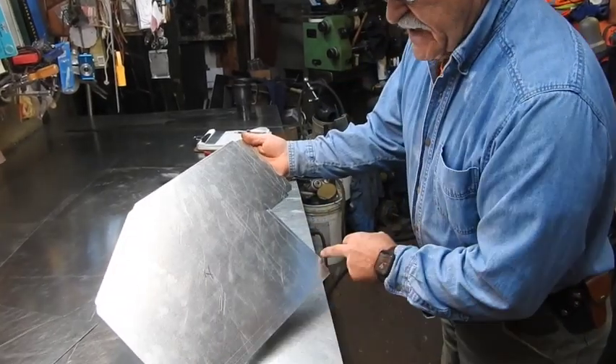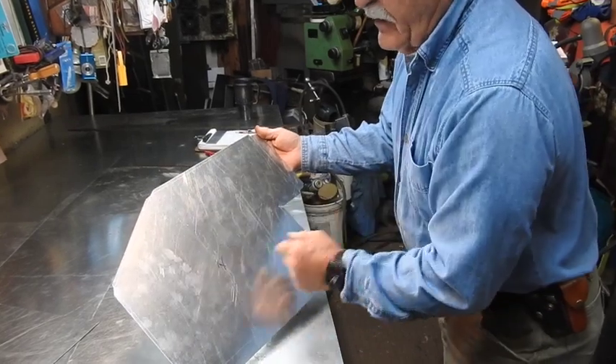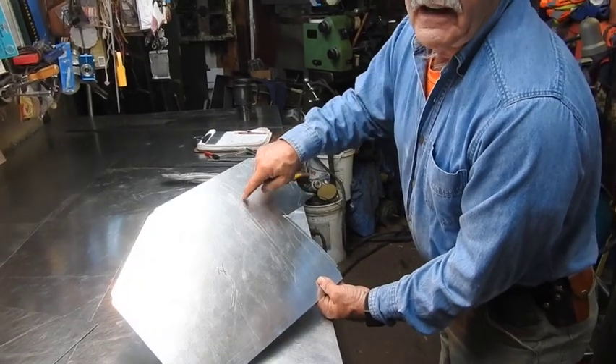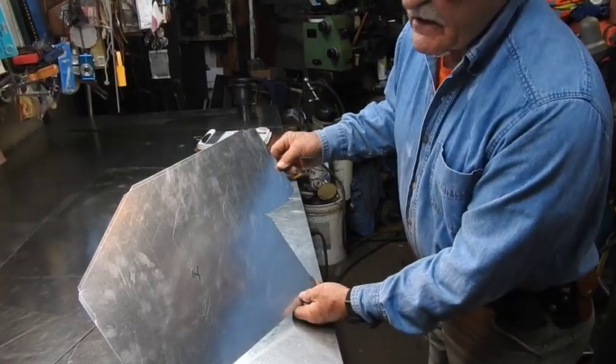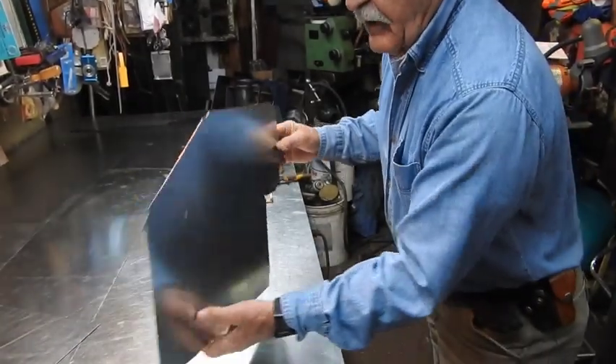Just a quick rehashing. Here's your 16 inch. We've got our double hem down here. Quarter inch all the way around for the outside wrapper. Quarter inch inside for the inside wrapper. We've got our 7 inch for the takeoff going into the side of the plenum. So now all we have to do is cross break this, fold it up, and we'll be ready to go.